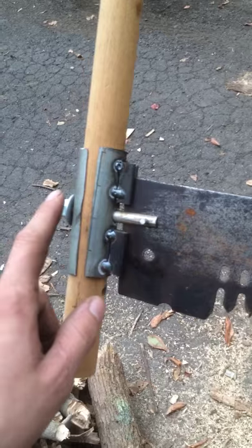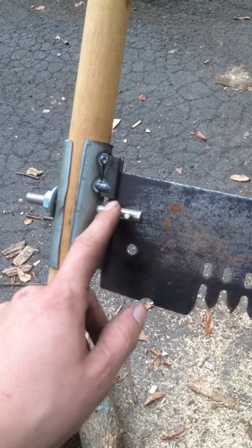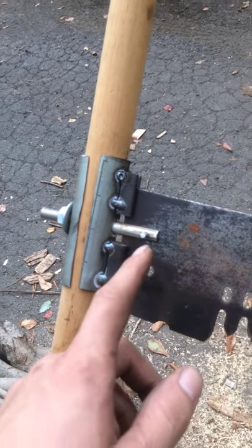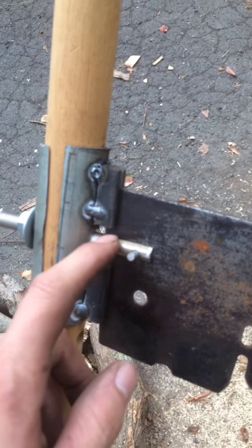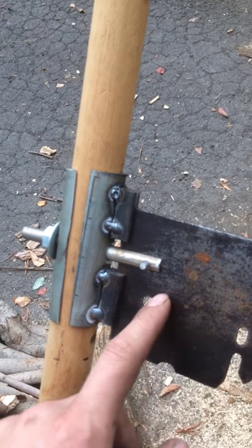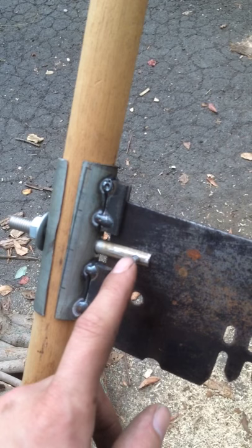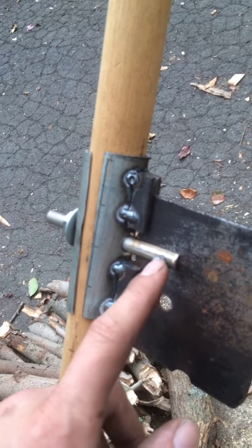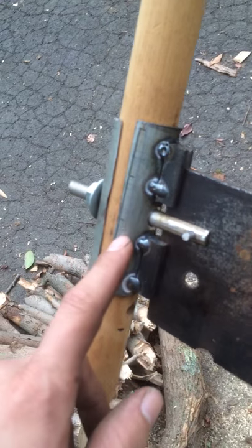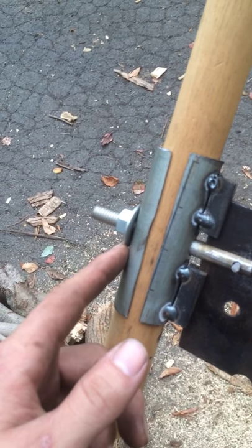After tacking the conduit and cutting it in half, I took a bolt — a little bit smaller than the thickness of my finger — and cut off the head. I took my cutting wheel on the angle grinder and cut a slot, enough so it slides freely on there. Then I took a center punch and punched right where the piece holds onto the saw, drilled that out, and drilled a hole on each piece of conduit. Then it's simply a washer and a bolt.